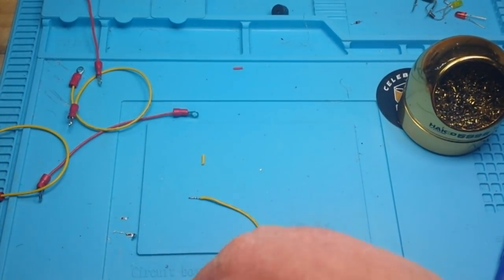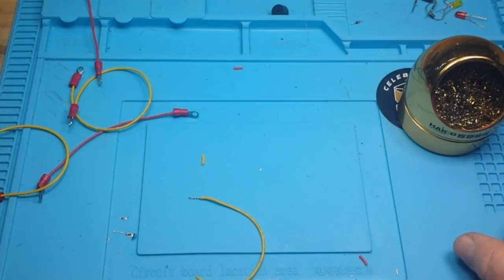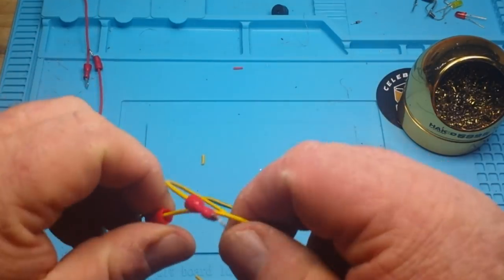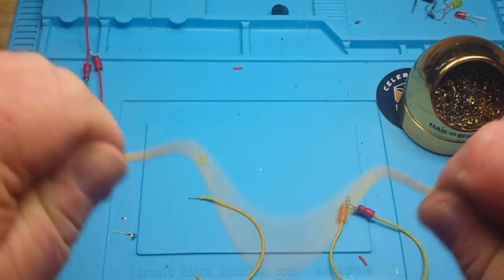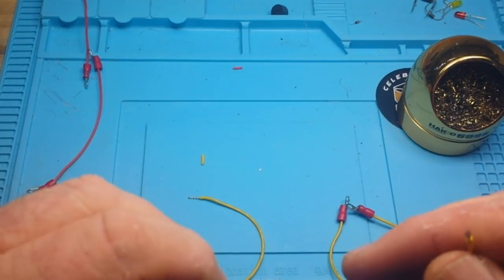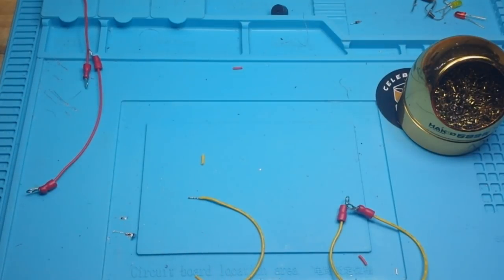So where do we leave this? I leave it with you and your experience. Crimping is the industry standard — a well-done crimp is a perfect electrical connection and also an excellent mechanical connection. I jerked pretty hard on that. Don't solder if you don't have to — that's what I'm saying.